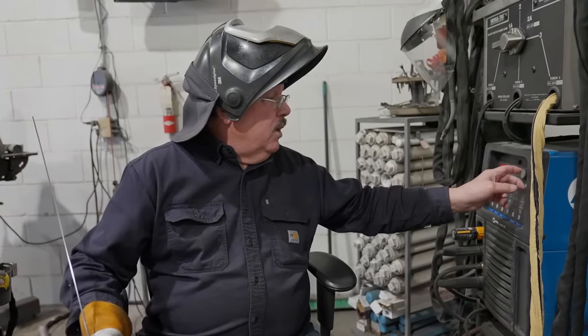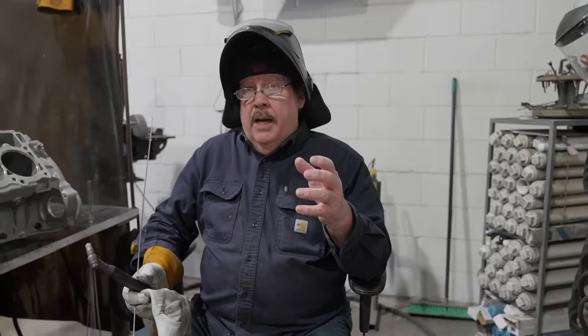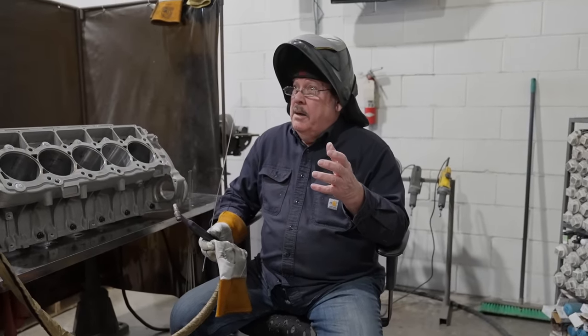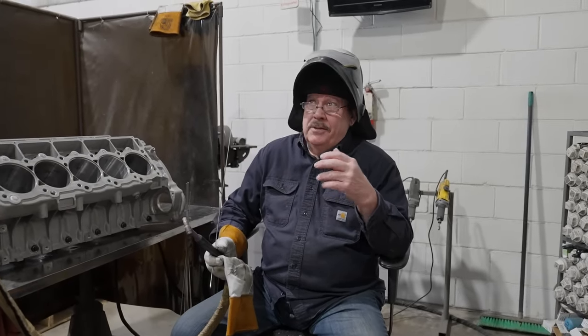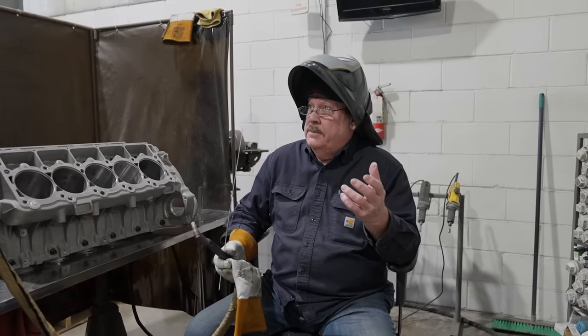Yeah, I'm only welding with straight argon. And if you're welding with straight argon, believe it or not, I've always found that if you get a high purity argon, a little more money, another 40, 50 bucks, it tends to weld better. Oh, really? Yeah, it makes a difference. Okay.